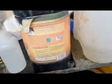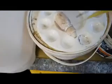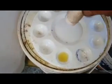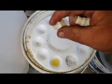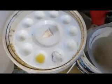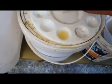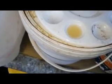So over here, I've got my gold test plate. You get a nice clean section. This one's pretty clean, and you put your gold solution in. Then you get your stannous chloride. And if you've seen one of my recent videos, you know that this is all fresh. But when I say fresh, it's freshly put into this bottle. It's actually over 2 years old, closer to 3 years old. Anyone that tells you stannous chloride has a shelf life, I'm talking snot. Alright, so we'll do a test. And as I expected, there's not a lot of gold in there. It'll change, but it's going to change very, very slowly. And I'll come back to it in a few minutes.